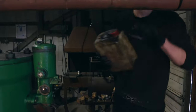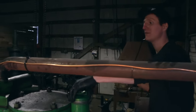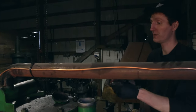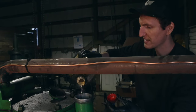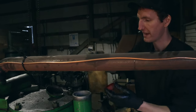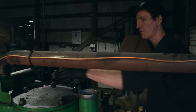One of the things I've had a hard time knowing is what kind of oil to run in this hammer. That was something Mark also helped me out with — he recommended running just straight 30-weight non-detergent. So this is the oiler for the pistons; just top that up. Good to go — and we're back in service.